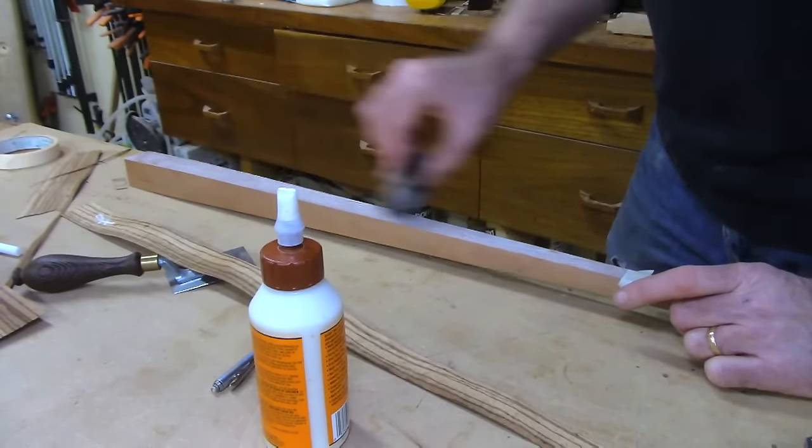It's kind of fun to finish these feet off and see how dramatically different the leg looks without a lot of work. You've actually brought the style up quite a bit to this leg. So I'll get one that's been in the clamps. There you have the normal method — I glued that side and the opposite side. You can see how nice those joints are. And now we're overlapped here because I did both sides — I can't veneer saw there because this flap is in the way, so you can also use the router table. Let's go buzz this off and clean it up and see what it looks like.